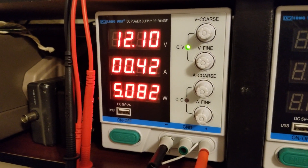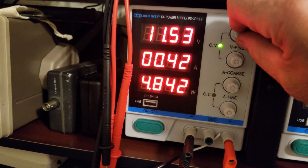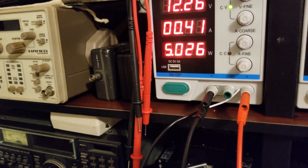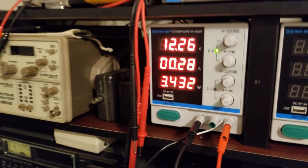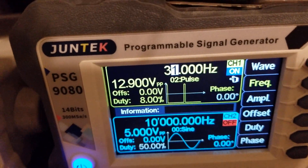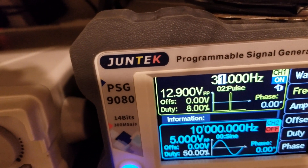12 volts, that's what it's idle on. If I drop that down, everything lowers. 32, so 12.14. Putting the sig gen back on. I don't know why it's going down — it shouldn't be going down, it should be going up. So 8% duty cycle — it's going down on that. And that's 12.9 volts, that's peak to peak.